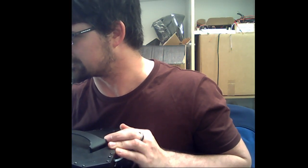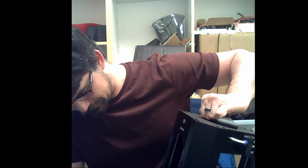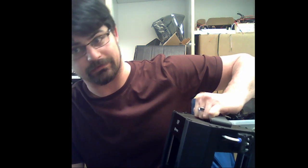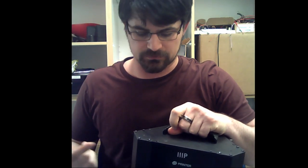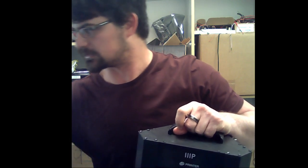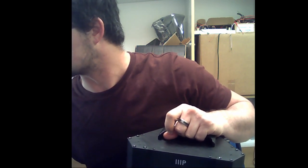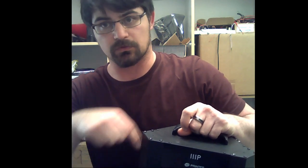Another thing about this printer is that when you do the bed leveling, it just thinks it's still printing. So if it cancels the darn thing, then you can actually go through and do another one. But if you add your bed leveling to the beginning of your scripts for your slicer, should work just fine. If you need to know that command, it's G29 P6 to get the full bed level.